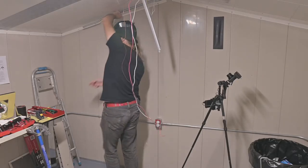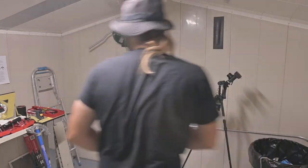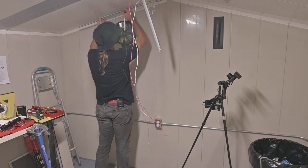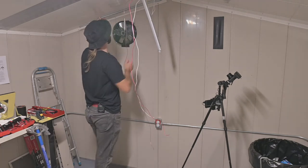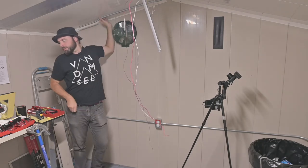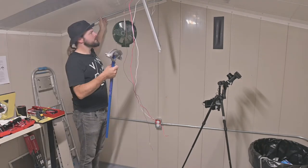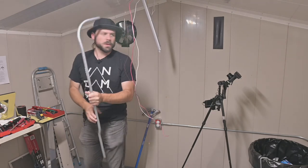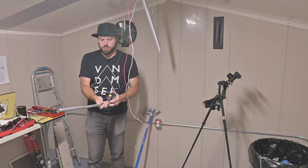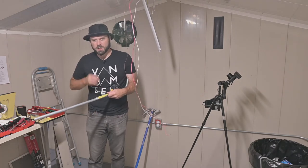Now the thing is, we're in a precarious position where we've got to calculate where the next bend's gonna be. I'm always using that term now. Right here, it has to go downwards. Now that's almost a 90. So I think if we use the stub rules, what was that, like 77? Yeah, that's almost a 90. So we're gonna use stub rules here. From this point where we want it to bend downwards, we're gonna come back 5 inches.